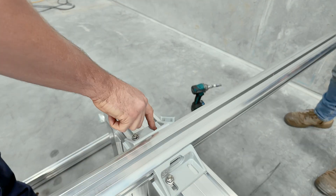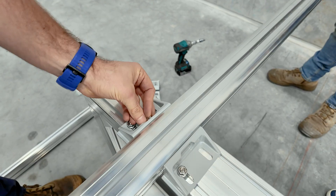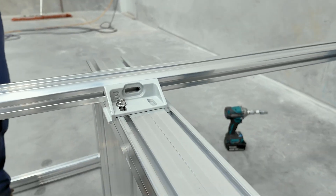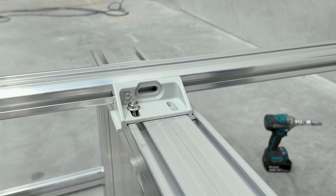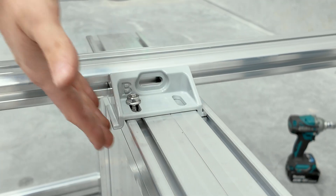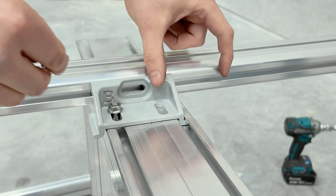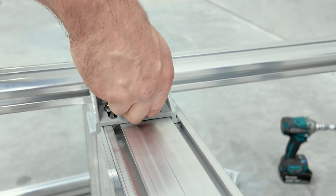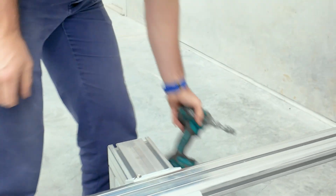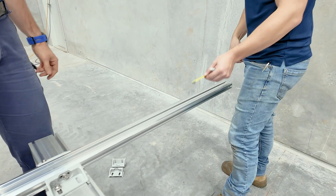You don't need to put anything in the opposing slot — no T-bolt will fit in there. The bracket is universal; it'll only fit one way. The bracket needs to underhang — the top surface and bottom surface of the platform means the bracket underhangs and can't be put the other way. To finish assembly of this post, we double check the dimension and tighten up all the T-bolts.